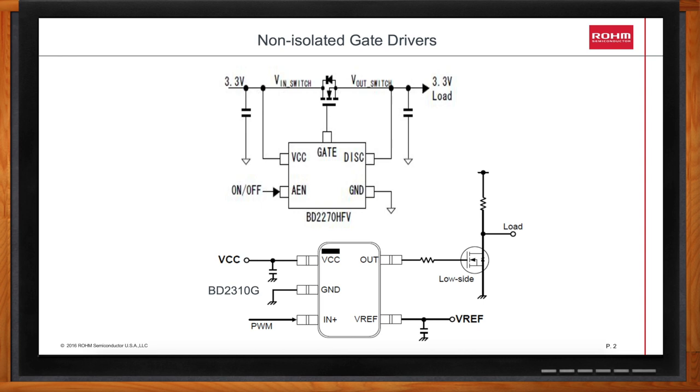VCC can range from 2.7 to 5.5 volts. Depending on the external MOSFET you choose, a signal from your microcontroller can easily turn on and off a 10-amp load. The BD2310G is a soon-to-be-available single-channel 4-amp gate driver, which can accept 2 to 5.5 volts PWM inputs. Recommended VCC is 4.5 to 18 volts, and the propagation delay is typically only 15 nanoseconds. It will accept input pulse widths down as low as 50 nanoseconds.